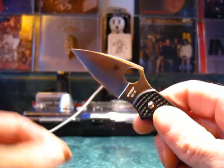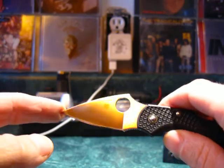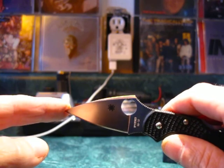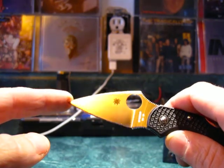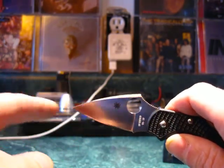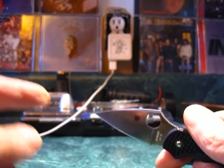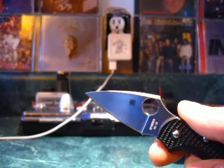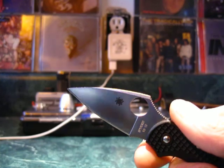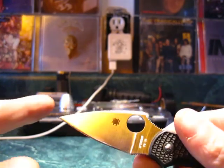This is a high-carbon stainless steel blade. Stainless steel resists rust far better and far longer than plain carbon steel because it has over 14 percent chromium in its composition. Chromium helps the blade steel harden and forms carbides — ultra-hard things inside the blade steel — that retain hardness, but it also has the benefit of making the blade stainless. It'll probably take a lot to make VG10 rust. Every stainless steel can rust eventually, it just takes far longer. So this is relatively maintenance-free — just wipe it down and clean it off every once in a while.